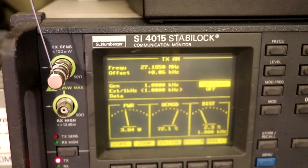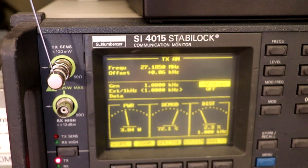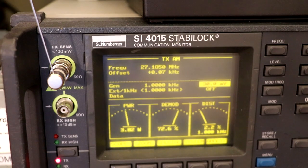And now I'm going to try to adjust our modulation pot. I'm going to try to turn it up just a little bit. And just more or less touching it puts it to 100%. And you can hear the tone. You can hear from the analyzer here that, well, that's a square wave. I can tell without putting it on a scope, I'm getting a square wave audio response there. It just sounds horrible. It just jumps from 70 to pretty much 100. There's just no adjustment there whatsoever. So I'm suspecting something wrong with the mod limiter.